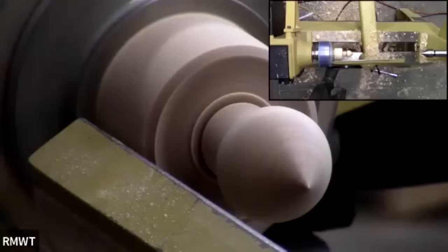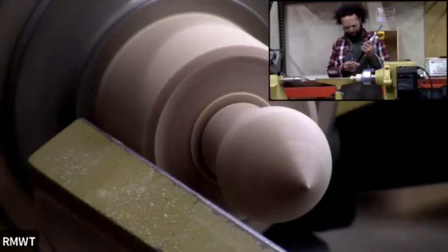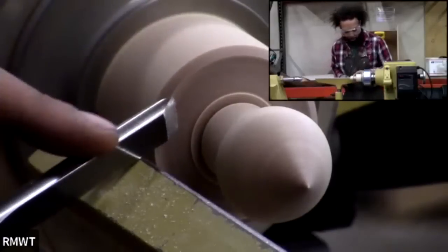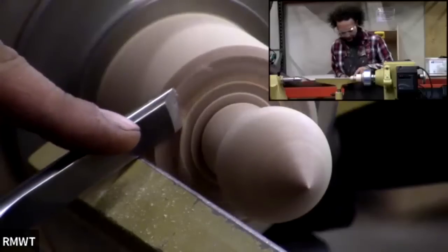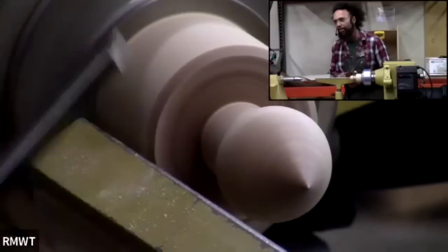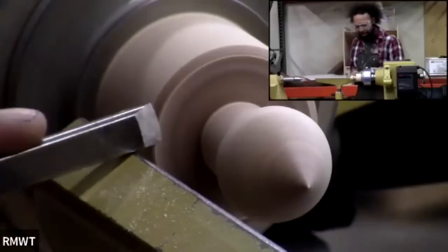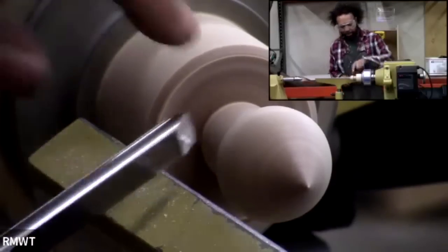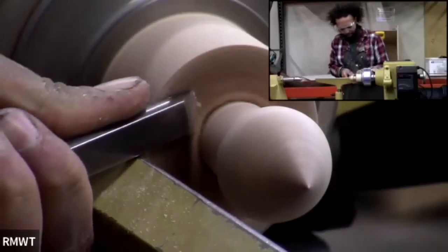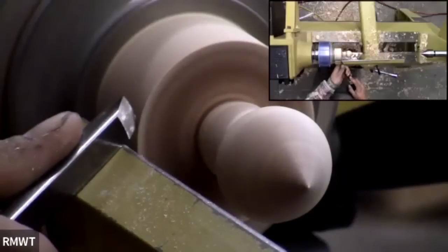The tendency that most have with respect to cutting across the grain is you basically are exposing quite a bit of that unsupported edge into the end grain. But that's not what's actually cutting. You can actually see that the cut's occurring right here. Can you guys see on video pretty well? Okay. And so what you want to do is just come in like this, not 90 degrees, but rather at a slight angle. And you'll see that if I'm peeling the end grain, cleaning the end grain, let's do a cut here. Just like that. So those are very clean cuts, all of those cuts.